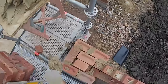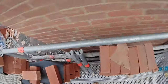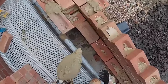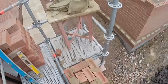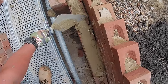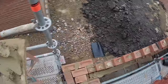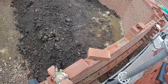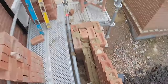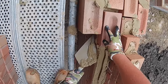I've got a bit of finishing off to do tomorrow night or Thursday morning. I've got that video I made with me topping that boundary wall off on the other site. There was a bit of brickwork on the squint panel that I'd built overhand, where I was getting over the brickwork below being a bit out of level. What I'd done wrong is I'd built two little rack backs, and then I'd lined them in and not checked they were perfectly level. So we've got a little bit of a curved effect with these two straight rack backs and the line between them. I've got to go and straighten that up with a grinder either Thursday morning or tomorrow night, depending on if I can be asked. A little bit of grinder action on about 4 or 5 courses of brick, just to make it look pretty straight, a bit of repointing, and jobs are good in there.